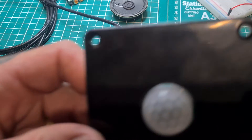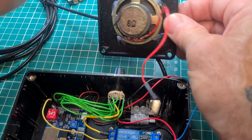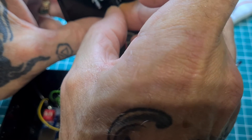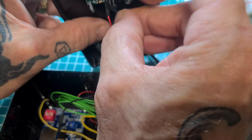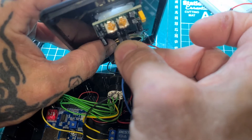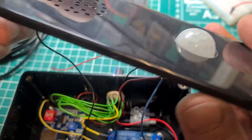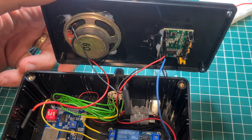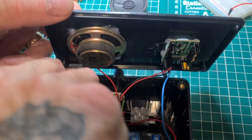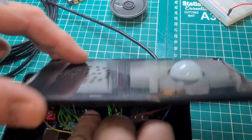That's the power for our motion sensor. Mounted the motion sensor and we put the speaker in. So the motion sensor powers on this one — goes there. That's neutral. And then the trigger, which will activate the relay, goes onto the middle one. That's how it's going there. All I've got to do is connect the speaker up like so. That's our little sound effects box, all sorted.